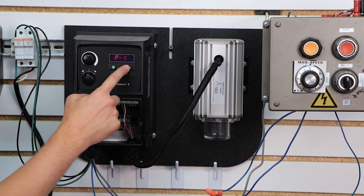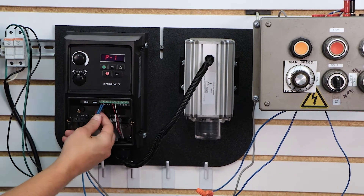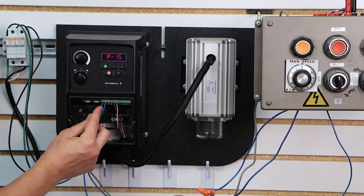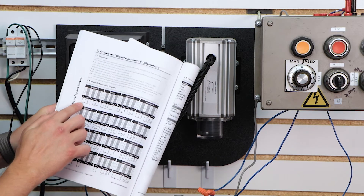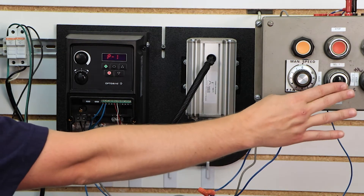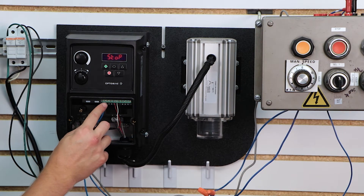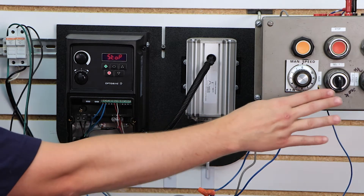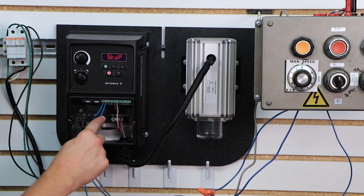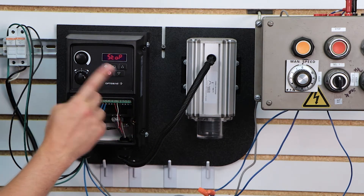Let me double check the macro just to make sure — yes, it is 0. Now let's check our wiring. What I have here are two blue wires coming out of the terminal strip. I have them for terminal 1 and terminal 2, just like on this print. This wire from terminal 1 is coming out to one side of my selector switch. The other side of my selector switch is coming back to terminal 2. This is a normally open switch. When I close it, it's going to allow voltage to flow from terminal 1 to terminal 2, and then it will actually issue my start command.